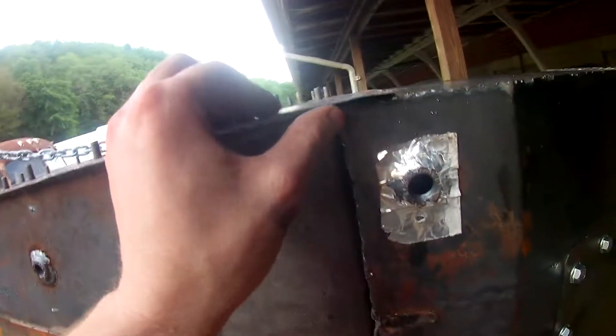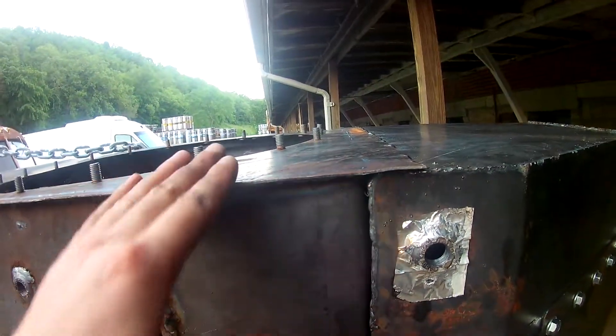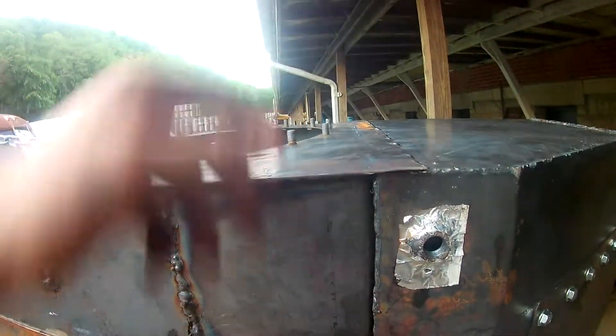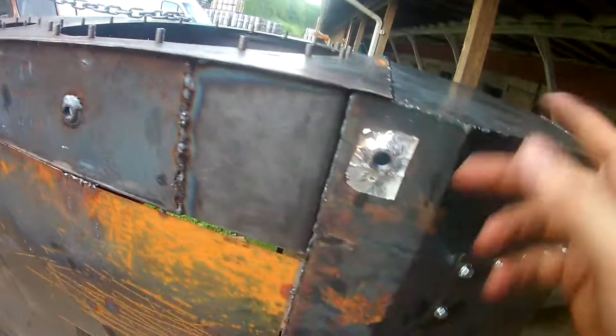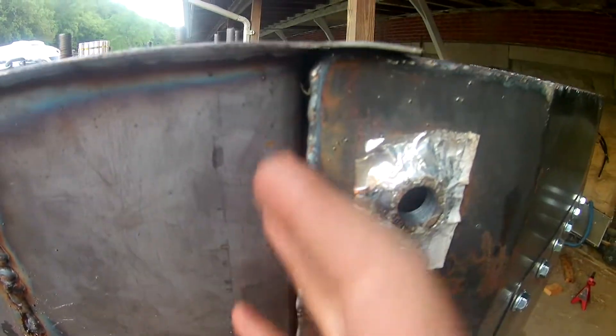What it turned out with the interface here is that the fillet weld was interfering with the bend radius. Turns out I misjudged the bend radius — it's a little bit smaller than I anticipated, so it was actually interfering. All I had to do was go back with the angle grinder, buzz down the reinforcement off the weld, and she bolted nice and clean as you can tell here.